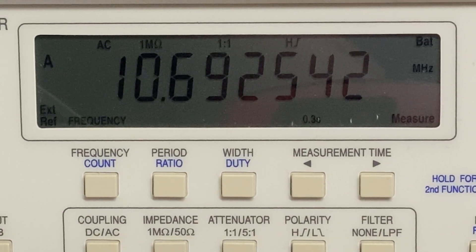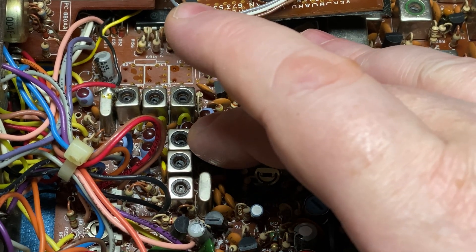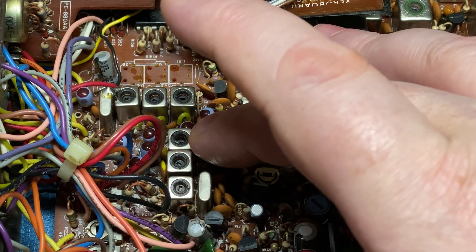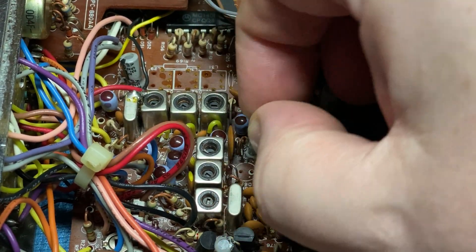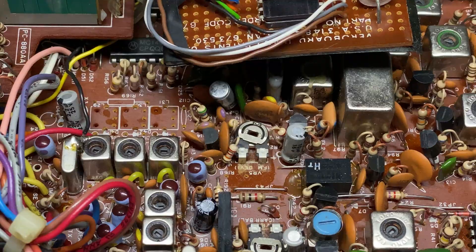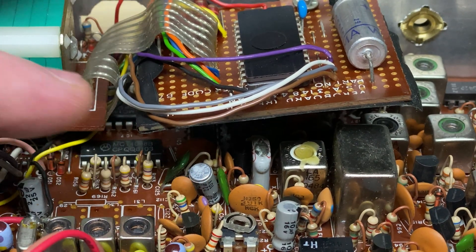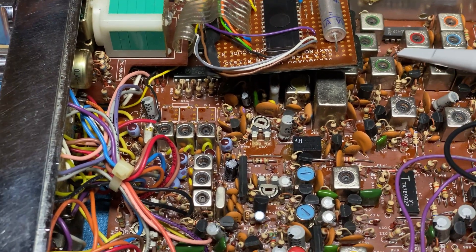On for some further investigation. Whilst I was going around I noticed this capacitor was a bit warm - it's a 10-volt cap and the chip next to it isn't hot. 10-volt caps in these radios do fail, so we take it out and replace it. I noticed this one as well - it looks like it's been getting hot too, another 10-volt cap. Absolutely bizarre. We've changed them anyway, let's see whether that improves matters.